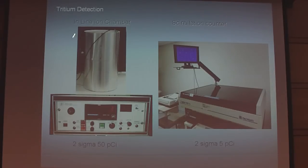This is also one of the things that we use for the tritium analysis. It's an inline ion chamber. It has the advantage of being able to see the tritium as you make it. However, it's not as sensitive as a liquid scintillation counter. A liquid scintillation counter, you have to recombine that on a copper oxide bed and then count it. And we typically will count it over a week. But